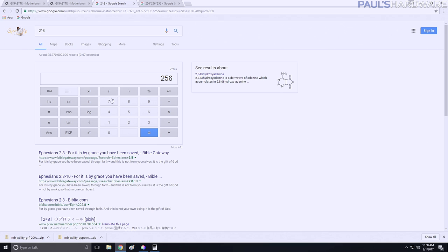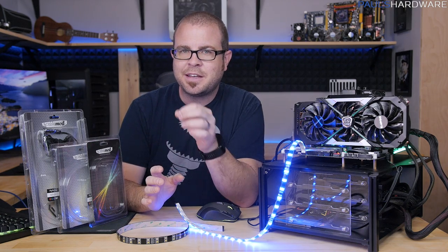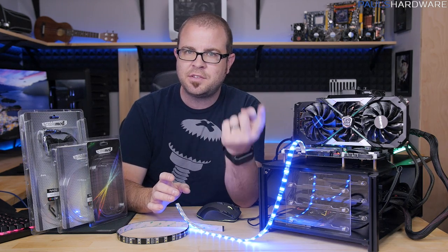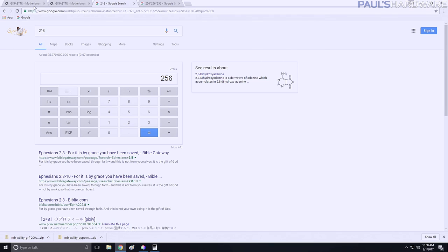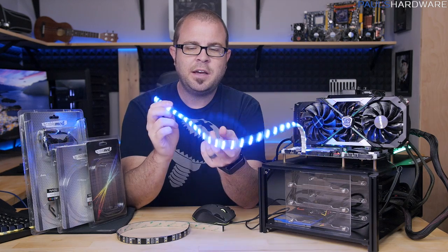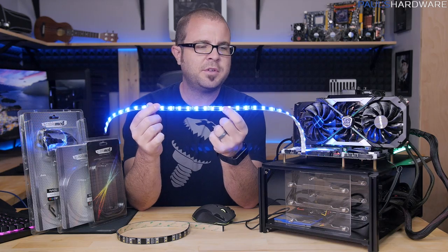You can actually do a little bit of math here: because computers communicate in bytes, a byte is 8 bits, and each bit can be in two states — 0 or 1. If you take 2 to the 8th power, you end up with 256. If you've used computers before, you probably see this number all the time because it's frequently used as a power of 2. Going back to the RGB software, a single byte of data is transmitted to tell each diode not what color it should be, but what brightness it should be.